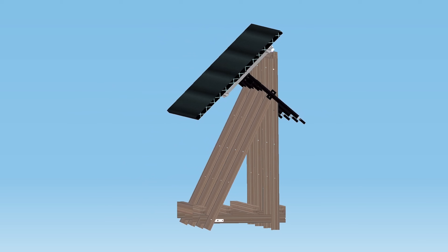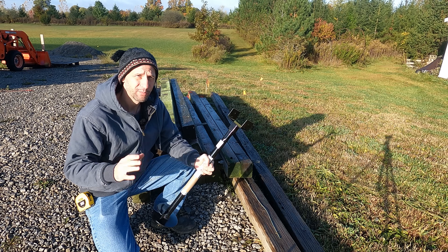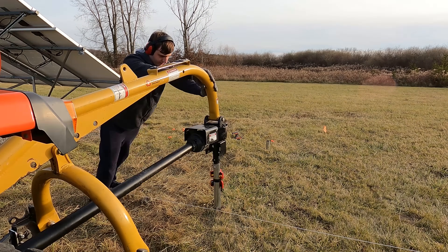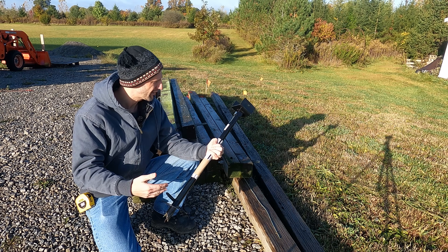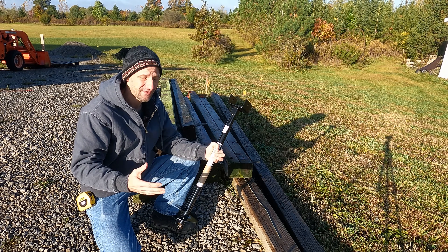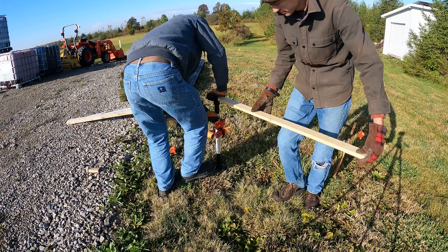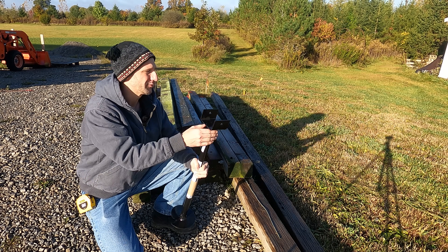The other big part is having sufficient strength on the backside to carry all the solar panels. I don't like digging holes and pouring concrete and setting beams. For my solar rack, I used a screw anchor I found on Amazon — this particular one's made by Pylex. I have no affiliation with them. You can get different lengths. Each one can carry 5,000 pounds and you can simply screw them in with a two by four — no special equipment needed. Since I'm not building a deck, I thought it was a good opportunity to try these out.